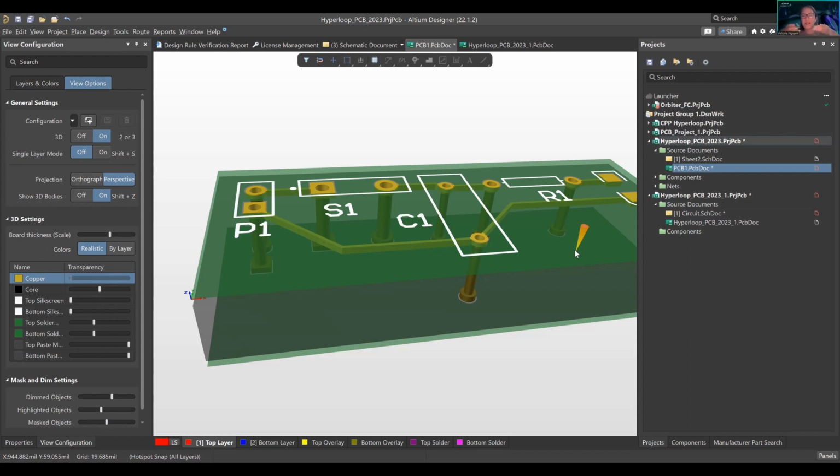So basically you have the copper. However, when you have the copper, there are no holes in it, right? Because we didn't drill anything through it. Then we'll have the copper that we want, and they'll move forward. They'll drill the holes into it. All the drills will enter in, blah, blah, blah, and then there's a whole process there that we won't get into. Then we need to add solder mask, which is this green area. They'll flow the solder mask over it, and do an imaging step again to make sure there's no solder mask on the copper. And then they'll add the silkscreen, which is like this P1S1. They'll add it on there.